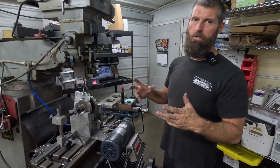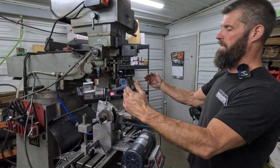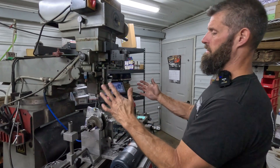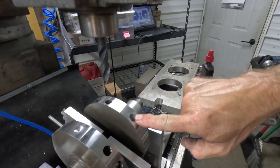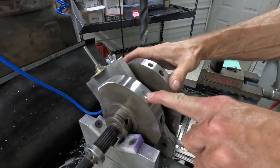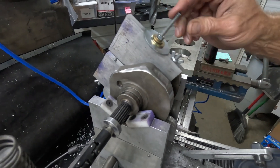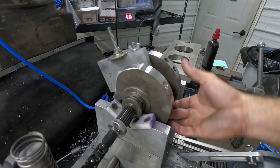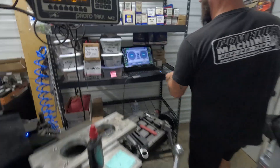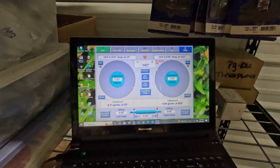I spun it again and had to work on it just a little bit more. We were down to almost three grams, and sometimes when you're working on one side in dual plane and getting closer to balance, you'll see one side shift away from the other. We ended up having to put a hole here on this side — it's not very deep — and then just a little peck right there, and then just a little bit of contouring with a grinder for that last like two grams. It shifted around over to here, so we just smoothed it up there without doing a bunch of drilling. We got it down to under a gram on both sides, which is more than adequate for the application.